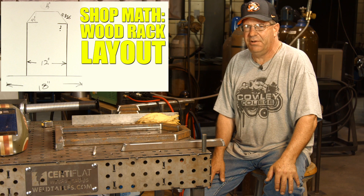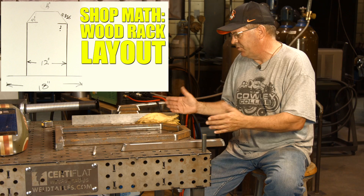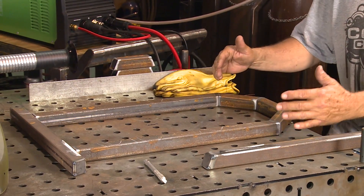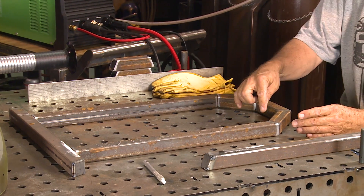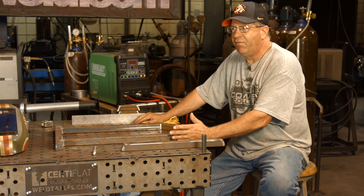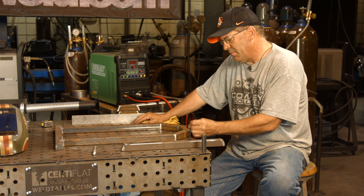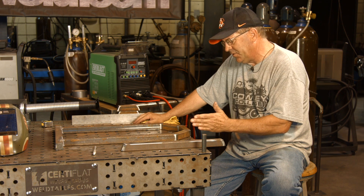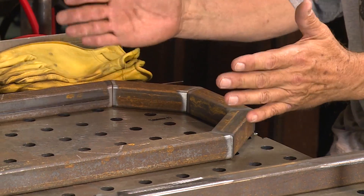In this recent video we had to use the inverse, because the customer requested the piece be 12 inches wide and we wanted to break it up with 45-degree angles. The inverse of 1.414 is 0.707 — one divided by 1.414. So if the measurement was five inches, five times 0.707 gives you the run in that direction. All these 22-and-a-half degree angles come out through the 45 and give us our 12-inch width.